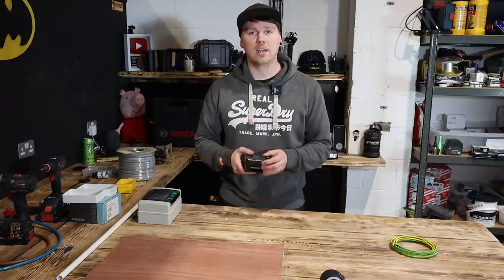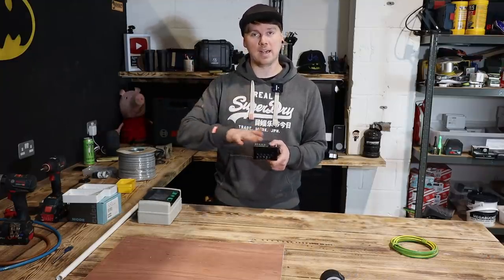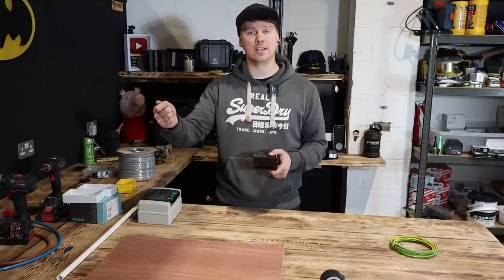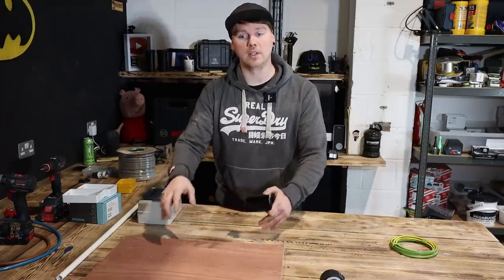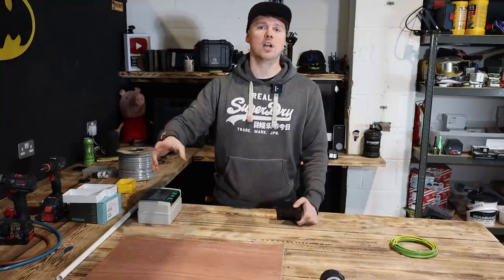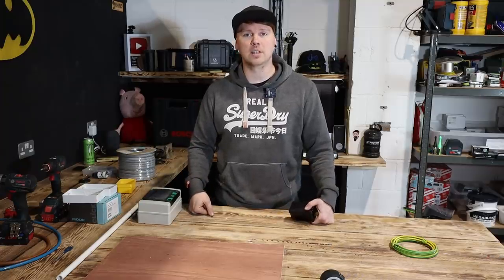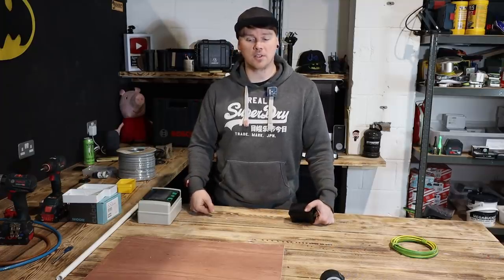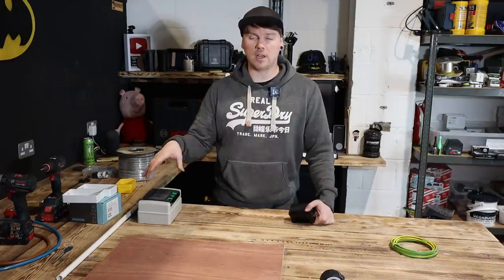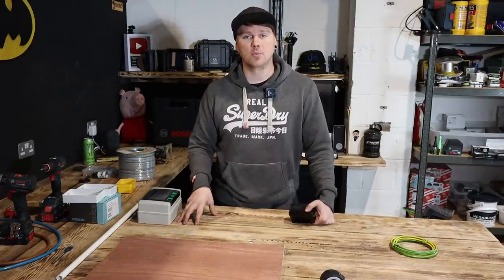With the Henley block, it allows me to tap off the existing tails. If there's a Henley block there, I can extend my cable from my Henley block to their Henley block. Or if they have a two-pole isolator on their property, we can feed that straight in. We can either secure this to the wall and leave it propped up against the side so it's secure. I'd always say screw it back, put some armband around the tails, keep them clean and secure. So I'm going to mark out where I want everything on the board and run through the process.